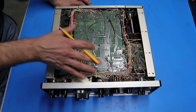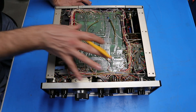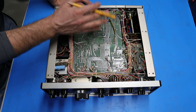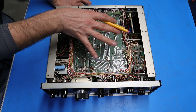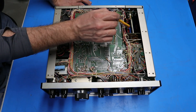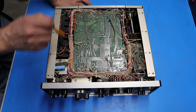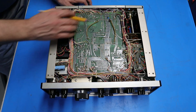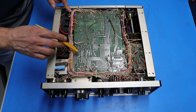I've flipped the radio over now. This is the bottom of the front panel, and the antenna connector is in this corner toward the table. The main board we're looking at is the bottom side of what Drake calls the parent board. All those other boards are mounted vertically below this board and plug into connectors on it. This small board right here is the ALC board, and over here is the bottom of the low-pass filter boards. Over here is the bottom of the heatsink connected to the power amplifiers, and you can see the bottom of some switches and controls on the front panel. There's a big wiring harness zip-tied and soldered to various points on the parent board.